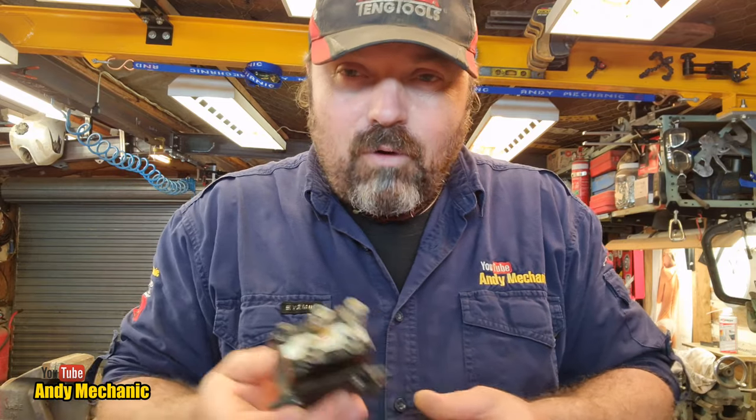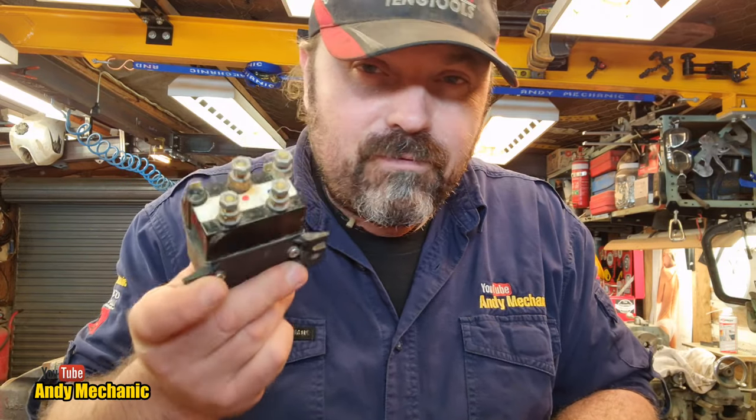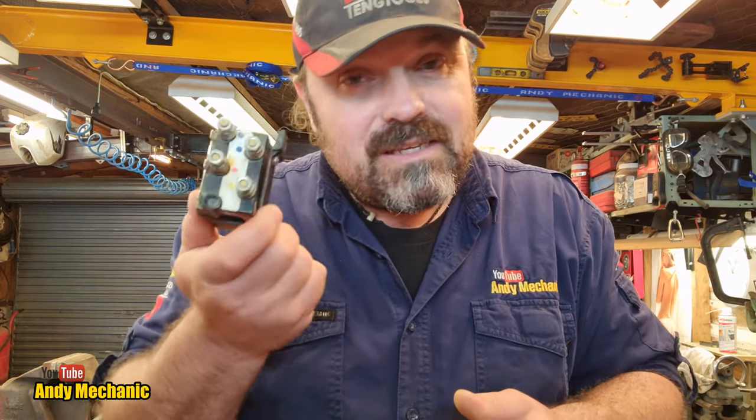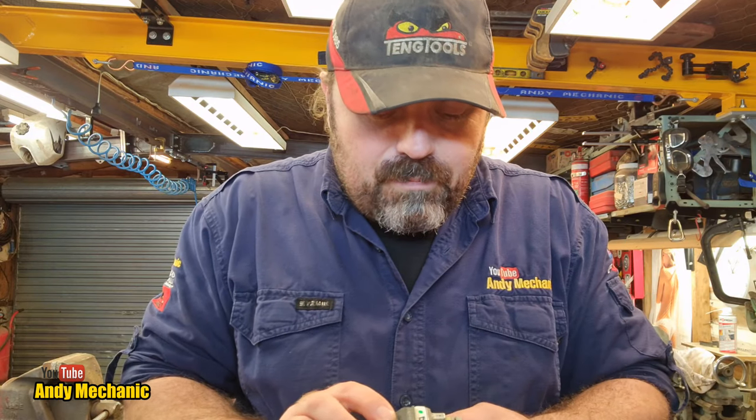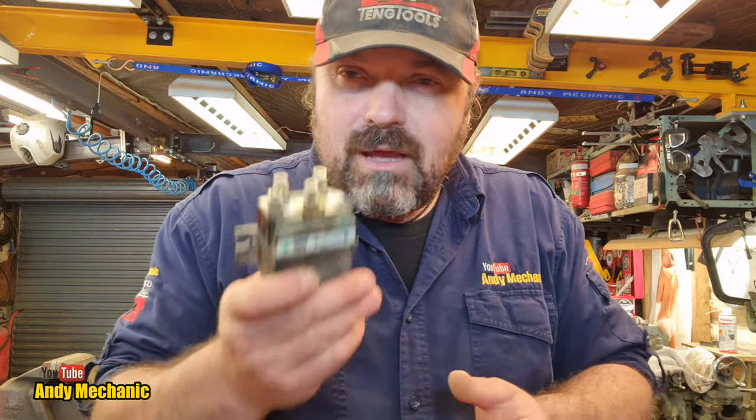This has a main benefit because it reduces the green crusties. Unfortunately, pretty much all solenoid packs are not fully waterproof, and we're going to pull this one apart later to see what problems moisture has caused — because this doesn't work properly. By turning off the power, it basically stops those green crusties from growing when the winch isn't in use, which is most of the time. Winches can lie dormant for months, then one day you get stuck and realize it doesn't work.